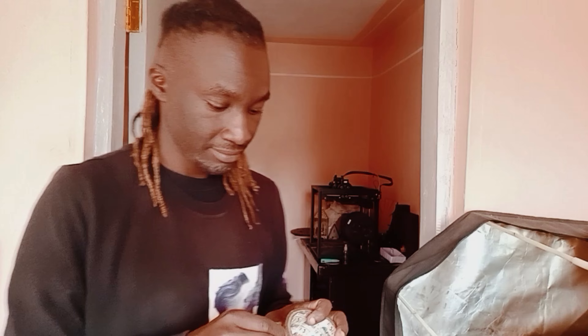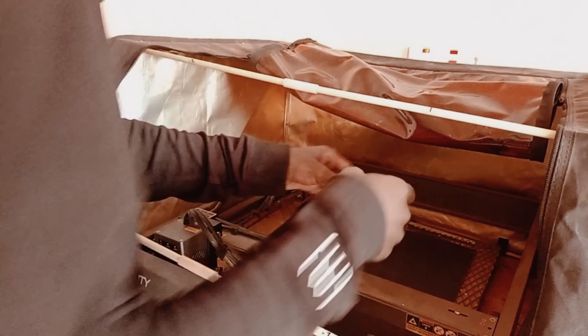Tape is not the best option, but since I don't have any weights around I think it will do for now. The tape is set and the leather is laying flat on the bed. One thing you want to check is that the tape is not too far inside the work area where the laser head will be traveling, otherwise it might cause problems cutting the leather and waste time and power. Make sure you put the tape right at the edges and then you're good to go.